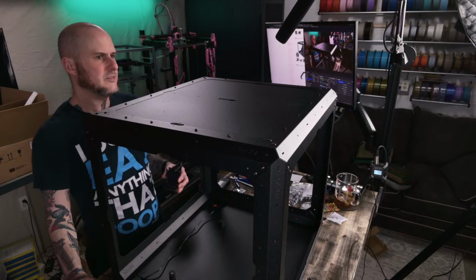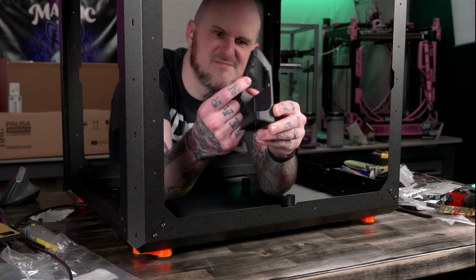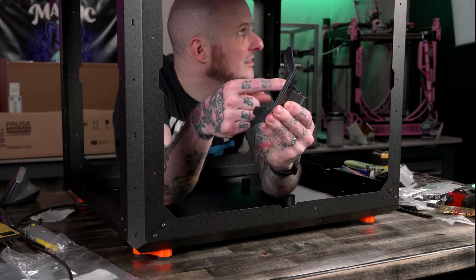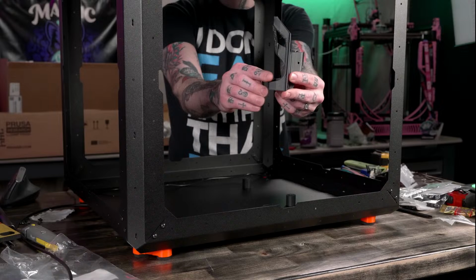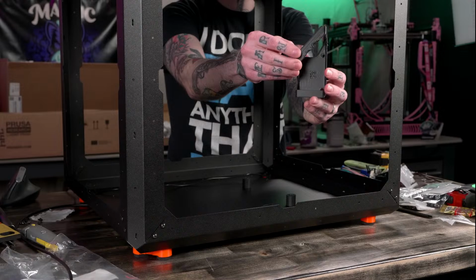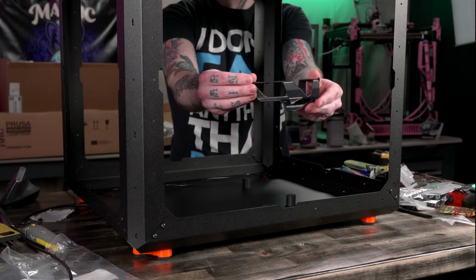This will be usable. It looks like shit, but it's usable. Crap overhangs. Like I said, this thing's all overhang. This printed beautifully. This didn't. It's all down to layer time up there. Down here, layer time was fine for the overhang, pretty much the same angle, but up here it's just a short little layer, it didn't have enough layer time. I need to slow down layer times to print this part better. Honestly, it's strong. I could use it like this probably. I just don't like it and want to reprint it.